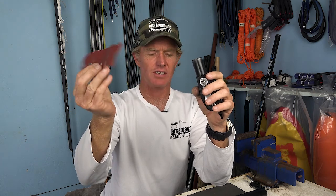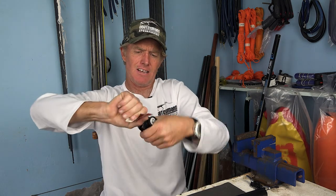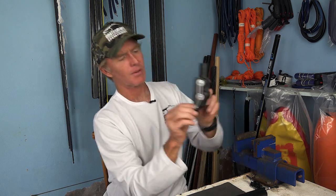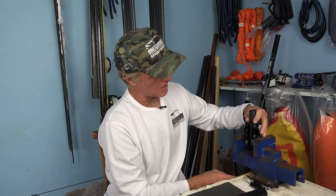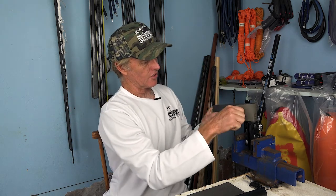It's better to take the muzzle down incrementally until it fits really snug inside the barrel - you don't want any play. The easiest thing to do is take some rough or coarse sandpaper, 60 or 80 grit is fine. Take an edge where it's nice and straight, wrap it around your hand and take off a few mils. Alternatively you can put it into a vice grip clamping across the axle so you don't damage anything, and work a strip of sandpaper down.